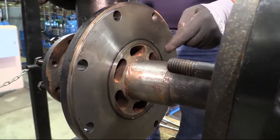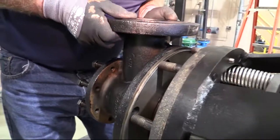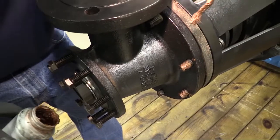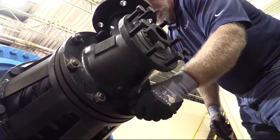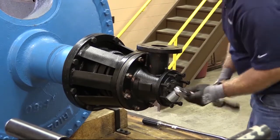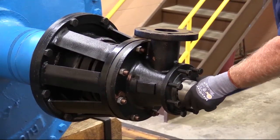Make sure the body O-ring is still in position. Lift the body and position it over the studs protruding from the ring bracket. Lubricate the studs with never-seize and secure the body with hex nuts. Tighten the hex nuts to the specified torque value using a star pattern tightening sequence. Tighten the hollow bolt to 300 pound-feet.